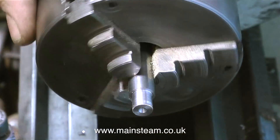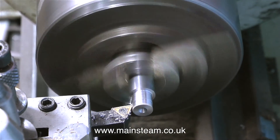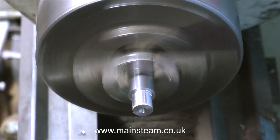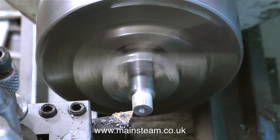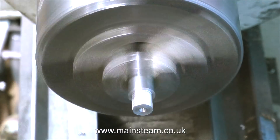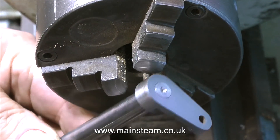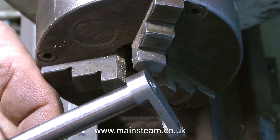What I should be doing is taking measurements all the time with the micrometer and looking at the numbers. Then I would rotate the lathe handwheel and look at the graduations — for instance, I may take one thou off. So I rotate the lathe handwheel just one thou on the graduations. But please remember, if you take one thou off on the handwheel, it's really removing two thou, and it's very confusing at first. But after a while, you get used to it. I didn't take great pains with this one, to be honest — this is just a piece of mild steel that's going to go in my spare pieces of mild steel box.